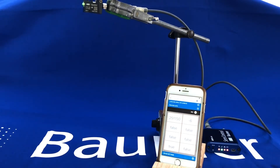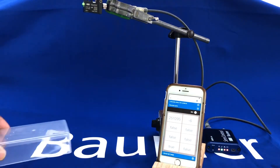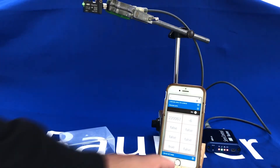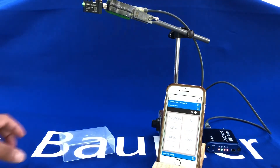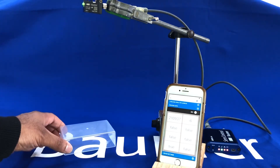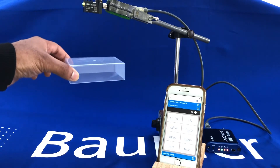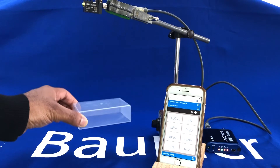Just to show on a clear type packaging — for example a tray or food packet tray — you can see I introduce that into the beam. I'm over 200mm away so the output is false. If I decrease the distance, you see the output goes true all the way up to the dead zone and back down again.